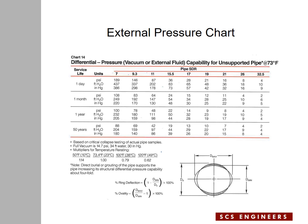For me to be on the safe side and conservative with these numbers, I normally specify a pressure difference between the casing pipe and the inner pipe of no more than 5 psi, which covers the majority of these SDR values with the exception of SDR 32.5, which has an allowable of only 4 psi. I rarely use SDR 32.5, but if it comes about, 5 psi is very close to 4 psi and I don't feel safe with that number.